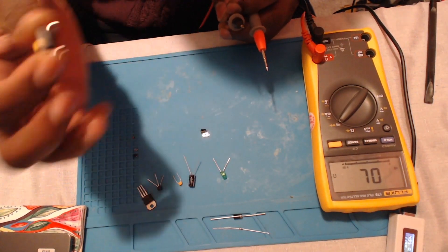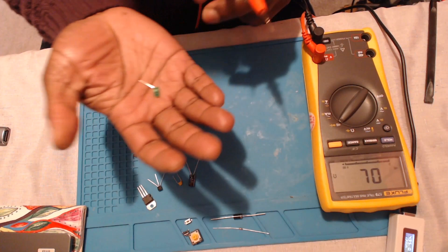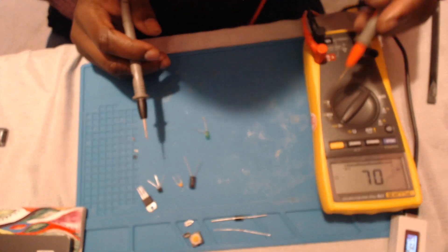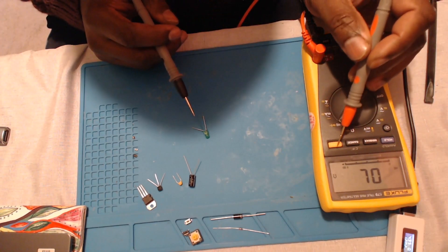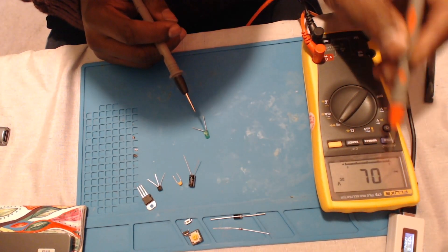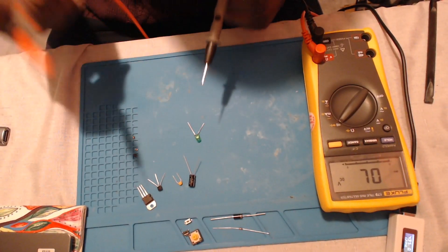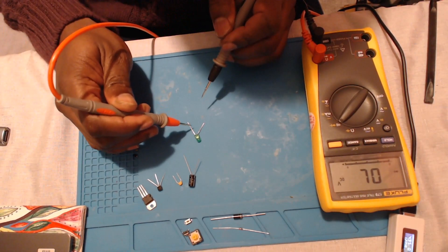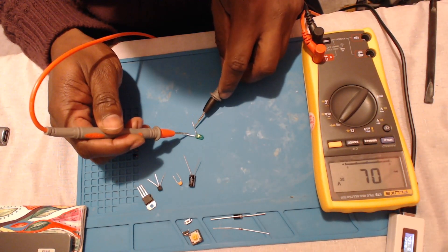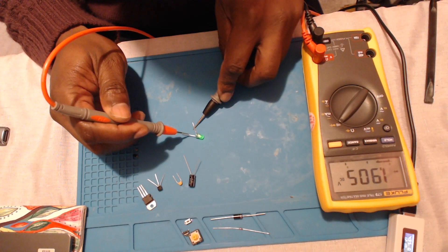So this four-pin switch is also probably good. Our next test is for an LED — a light emitting diode. The name diode tells us we should use the diode function on our meter. Let's switch back to diode mode: we want the arrow with cross, not the speaker for continuity. One press of the yellow button and we're back into diode mode. One of the LED pins is sometimes longer — that can be the positive side of the bulb. Let's take our positive probe, place it on the longer leg, and our negative probe on the other one. We should get a little light, and the meter jumps up to 1.9.